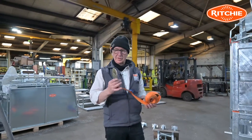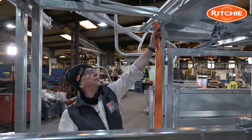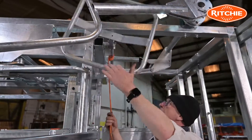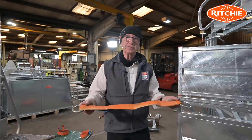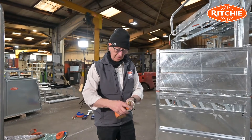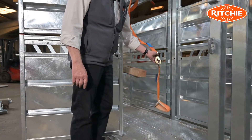We'll now attach the rear leg lift strap — that's the long one with the parrot-nosed clip on the end. You feed the end of the strap through, and by turning the handle or wheel it locks the strap into position. In addition, we also supply a short strap designed for going round the leg or hock of the animal. One end has a small ring, the other end has a large ring — one feeds through the other. You hook it round the leg and clip it into the parrot-nosed clip, ready for lifting the back leg.